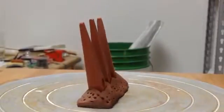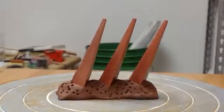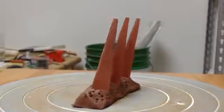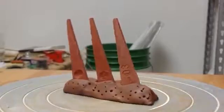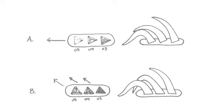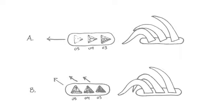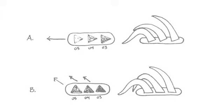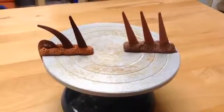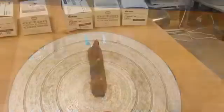Another thing to notice about how I've placed the cones into the coil is that they are facing so that they will fall slightly to the back rather than directly in a row. This is because you run the risk of one cone melting and then the next falling into that and not being able to fully fall. In example A, the cones are placed directly in a row and the second cone is starting to fall into the first. In example B, they're falling slightly behind one another and that lets you see how each cone is melting. Here's a fired cone pack and an unfired cone pack — the fired one helps you see how one cone will fall slightly behind another if you put them at the correct angle.